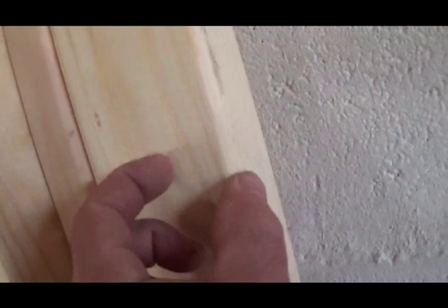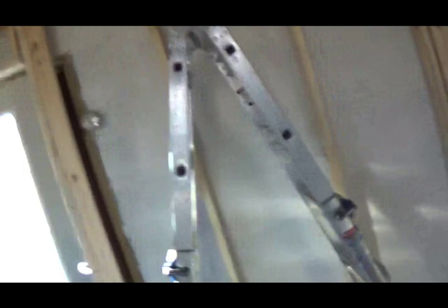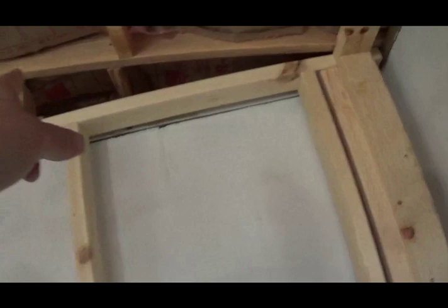So preassemble the partitions. Instead of doing this, and then a block, and then this, I just do an L, and that's more like shack framing. Same thing here. The thing is, you always want something to screw to. This is just such a small area that it doesn't really matter. There's not going to be too much flapping going on. I could do a piece for this door going over, and then a piece like this.